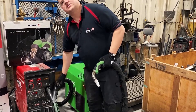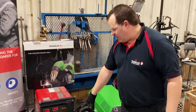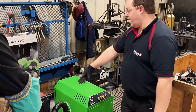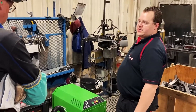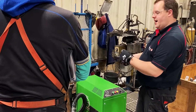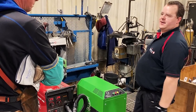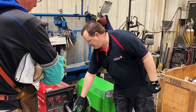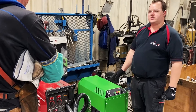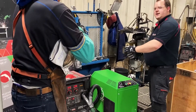On this Y, this is what goes to the vacuum source. From the Y branch, we can run anywhere from as low as 5 feet up to 60 feet away in the shop per welder. We have different scenarios where some customers want the vacuum next to the welder, some want it further down the shop or higher up or out of the way. This unit I brought today is a single welder unit — it's the Clear02 W100. This version is for one welder.